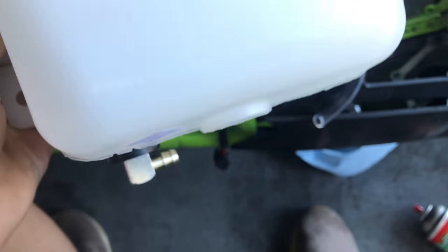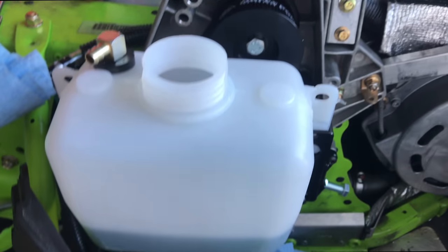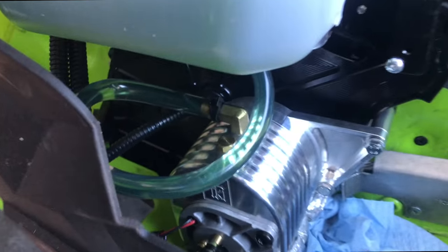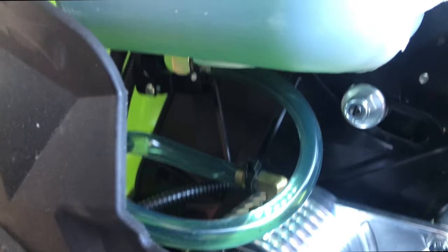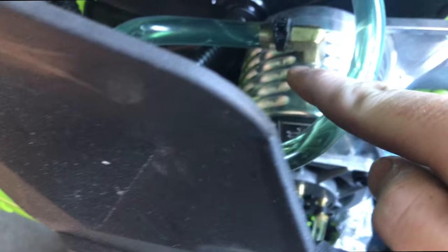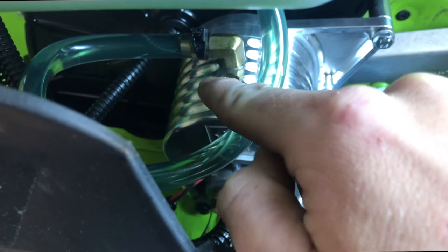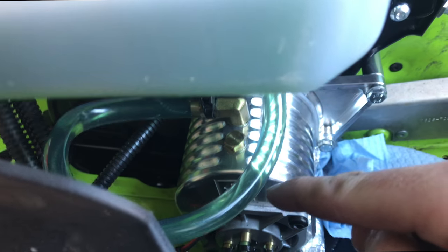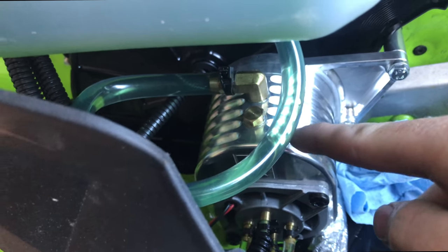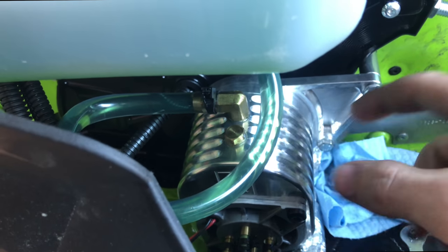Then you're going to want to run your hose from the top of the pump into that bottom hole, and you can fill the tank about halfway full so you can bleed the air out of the system. Once you get it all hooked up, fill the tank up a little bit. Fill it about halfway full, then take this nut out of the top of the pump and try to push the air bubbles through the hose. That will help it go quicker. Leave that open until oil starts coming out, and then your whole pump is bled.